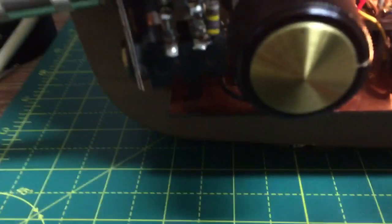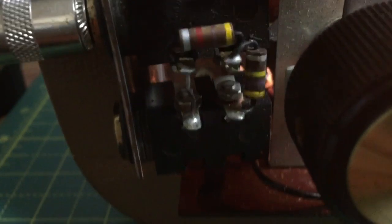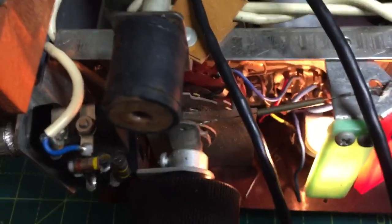Yeah. No burning. Smell it. Always give a good smell to the circuitry when you're going on for a while. Can't beat your nose. Nothing. Always check the components, see if there's any smoking going on. You should really plug into a variac when you're doing all this stuff. I have got one, but too lazy to use it. I can smell the valve burning, sort of old dust. Components are okay. Call that smell of old burning dust, my God.